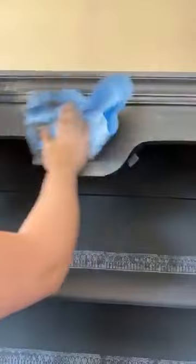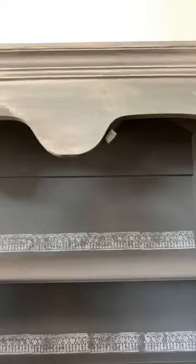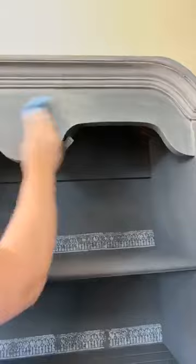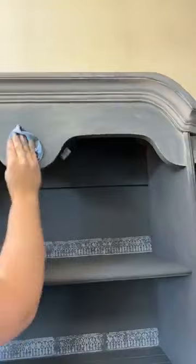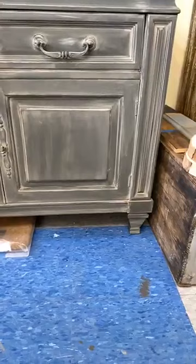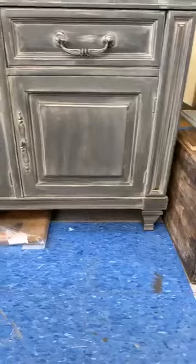I want to see you blend that — when you start and stop, that's where sometimes people get a little nervous. Right there it looks a little funny where the seam is. That's another place I would take my spray bottle — spray on the cloth and lightly go over it to blend the seams. Don't be afraid. After doing a wash I'll sometimes take sandpaper and even out the surface, distress some areas. When it's busy like that you don't notice small imperfections.